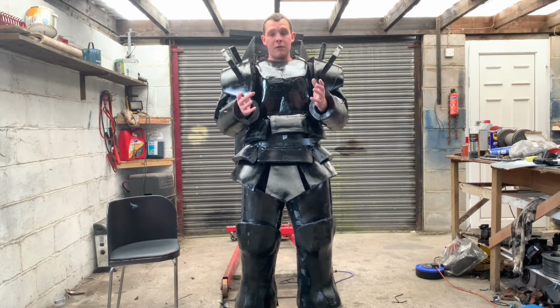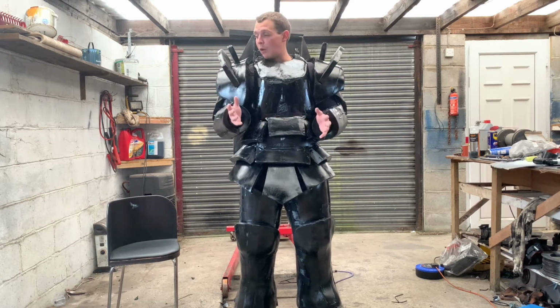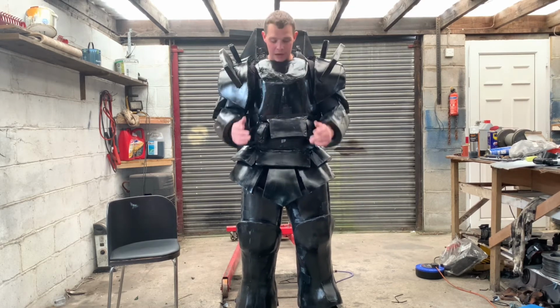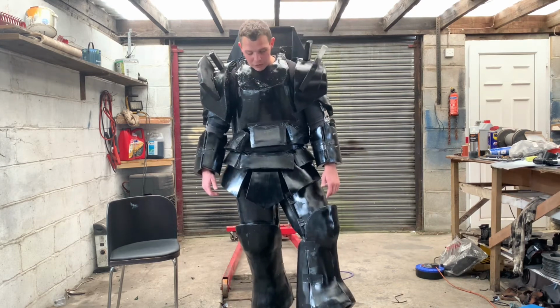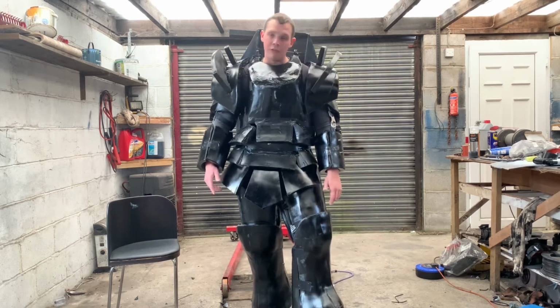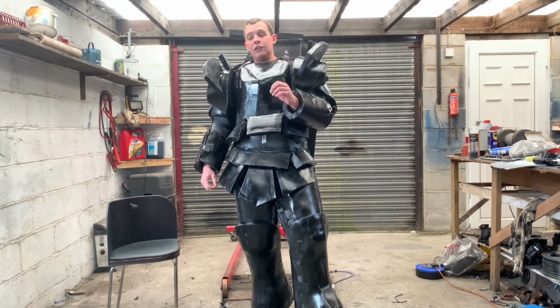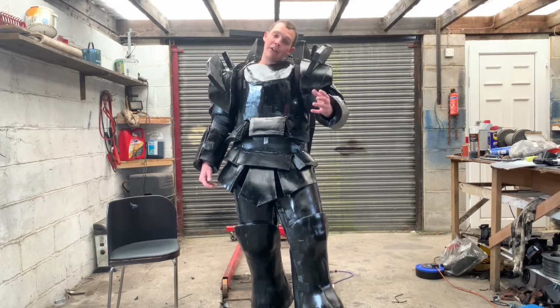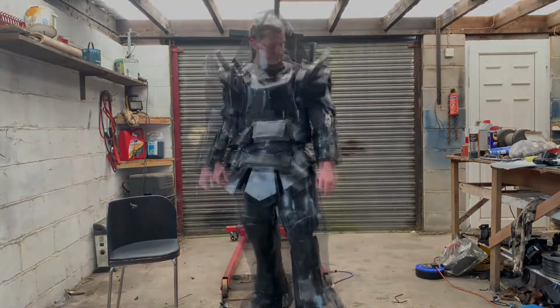But if I make them smaller, then want to make them bigger, I can't really do that, but I can always cut them down. So that's why it's way more chunky than it could possibly ever be. Stuff that works particularly well, despite looking extremely chunky, is actually the legs. And the feet work alright apart from the soles, which I still haven't done yet. Haven't done the soles yet because you need to know the weight of the suit so you can work out the correct surface area for the soles so you don't sink in mud, etc.